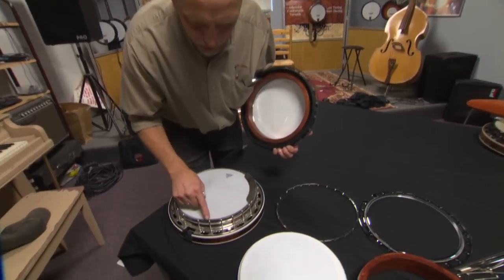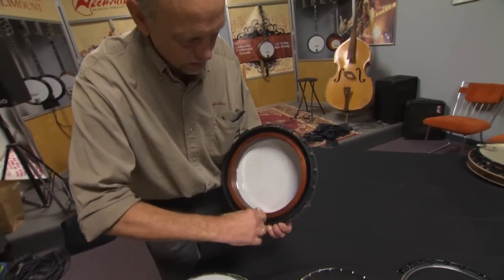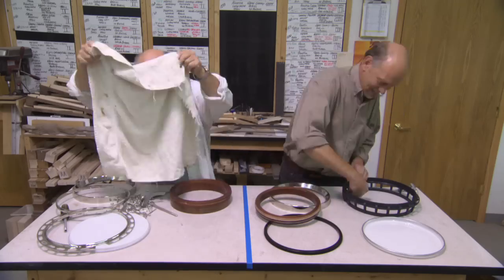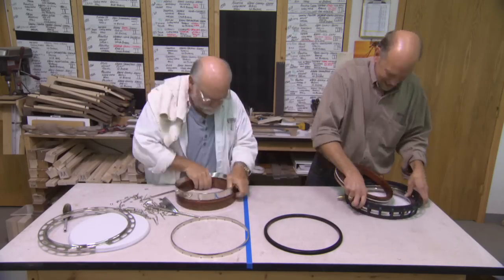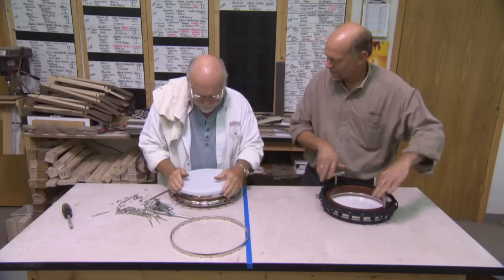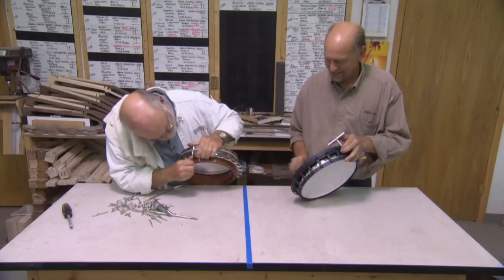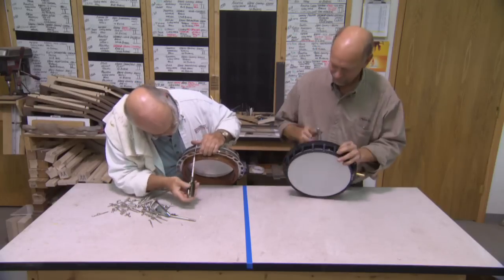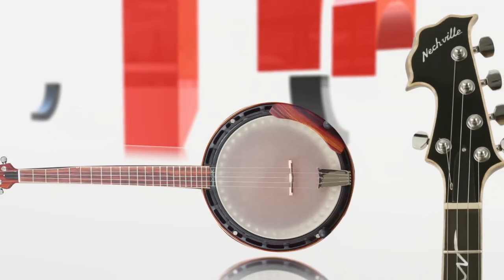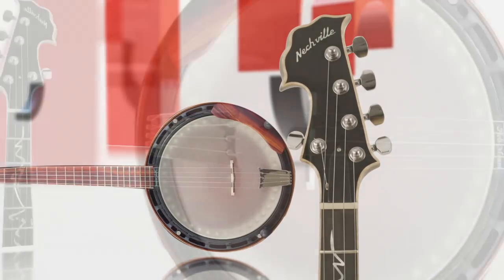We have wrenches like this to tighten it up with. I don't have to tighten each individual hook and nut — I have one mechanism that tightens the whole banjo at once. If I had all the parts in front of me, I think I could put one of these together in just a few minutes. The standard design does require a lot more time to get all the nuts and hooks equally tight. You don't hear the hardware; you just hear the part that was made to make the sound.